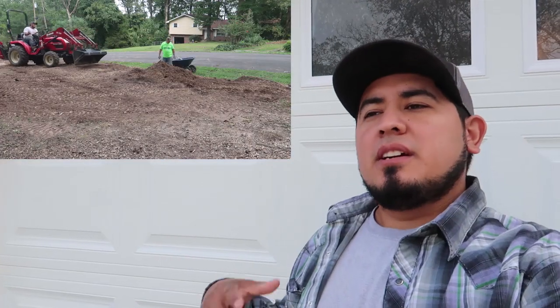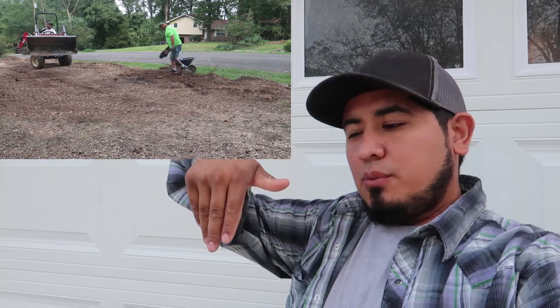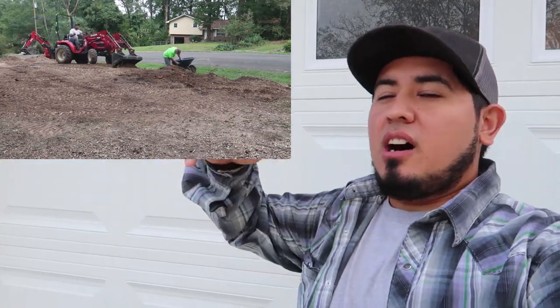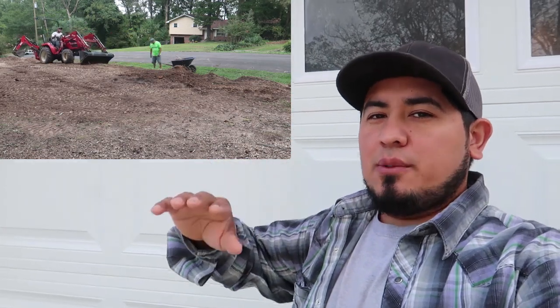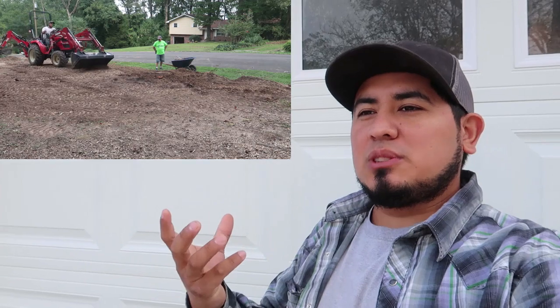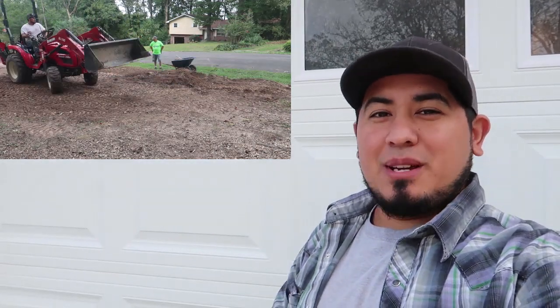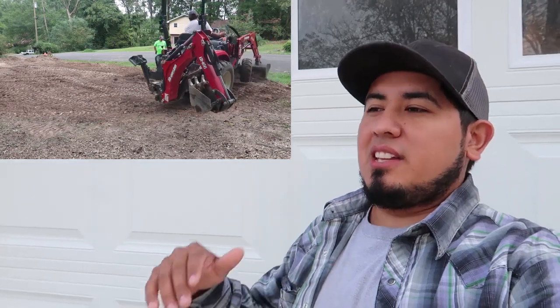In this clip, I wanted to go through there a few times with the bucket tilted inward and start scraping it, kind of smoothing it out, but I didn't only do it for that reason. I also wanted to compact that dirt a little bit more, because it was so loose that I knew if it were to start raining, since it's on a little bit of a hill, it would start washing out and make a big mess. So I've got to make sure that it's nice and compact before the rain.